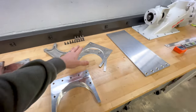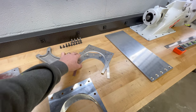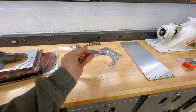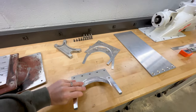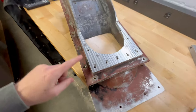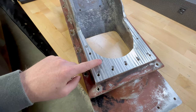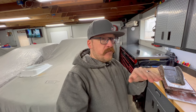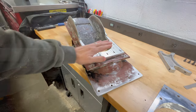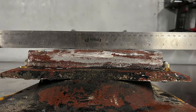Typical shoe and ride plate setup: I have shims here — one's 125 thousandths and the other is 60 thousandths. I got the brace to put onto the bowl, I got the shoe which has provisions on the back trailing edge so the ride plate can bolt on, and then I sent my intake off and had it machined. Now, one weird thing is this intake has a different bolt pattern and it looked like at some point someone drilled the pattern for a shoe into it. But when I pulled it out of the boat it didn't actually have much material machined off the back for a shoe — it looked like someone took a hand grinder and rounded it where the shoe material sat and gave it a little bevel to match the keel.